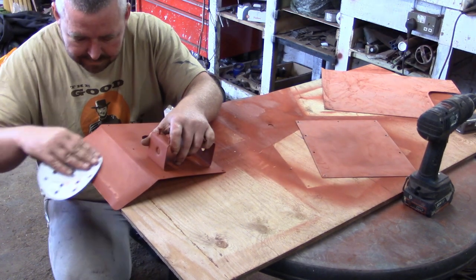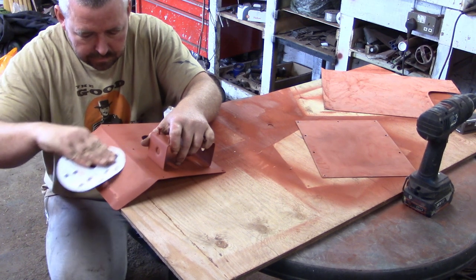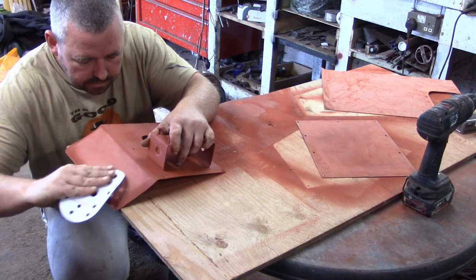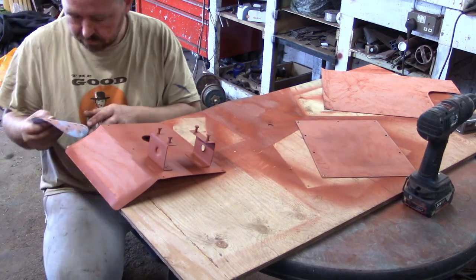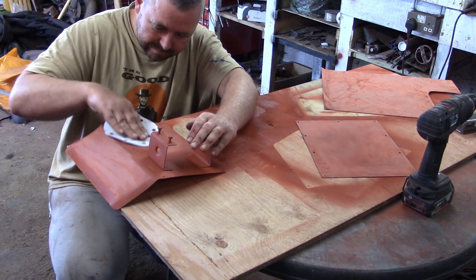Yeah, a lot of the problems I'm having with paint were because I'm not filtering my paint. I'm using pots of paint that I've been using with a brush, and I've contaminated the paint a lot. I should get some paint filters, really. It'll save a lot of these issues. I had the gun block a couple of times.